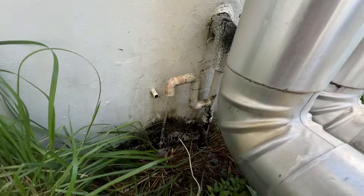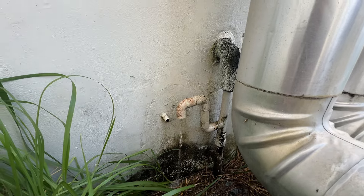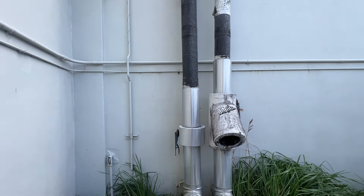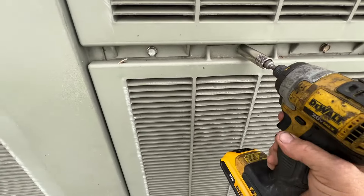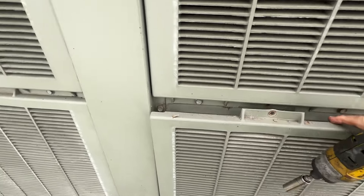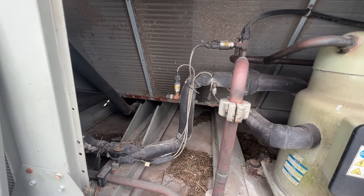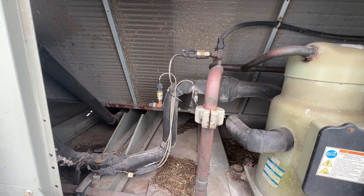No doubt the air handler is working. This is our condensate for the air handler - it's on the other side of this wall here. This serves a big auditorium. Chiller just cycling off on water temperature. And what they did tell me was, I guess they had a power surge or something, and it tripped the pump starter, so that's why we had loss of water flow.